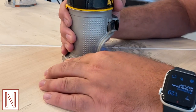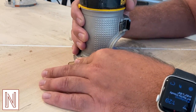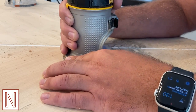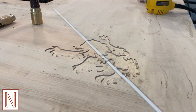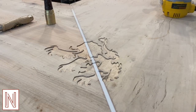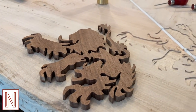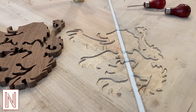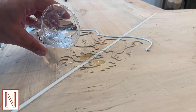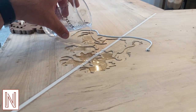But I'm okay with that. Once the outline is cut, I hog out the rest with a router and various chisels. I used epoxy and some clamping pressure to secure the inlay in place. And for all the error here, I think it turned out okay.